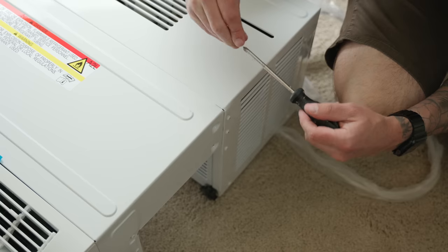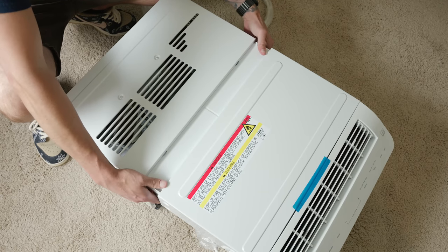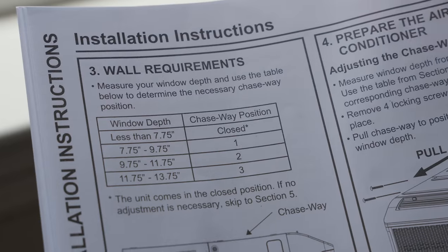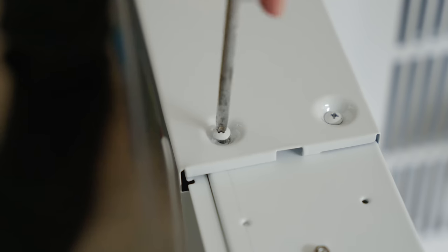The Profile Clearview features an industry-exclusive flex depth feature. It can accommodate walls and windows from 4.5 inches to 13.75 inches thick. The way it works is you unscrew the four locking screws — two on the left and two on the right. Once those are out, you can extend the unit to four different positions including the closed position. Check the install instructions chart to find what position your unit needs, set it, place the locking screws back in, and tighten them down.